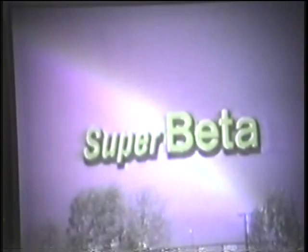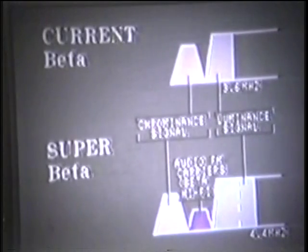But first, let's examine the difference between SuperBeta and conventional beta. The most noticeable difference in SuperBeta's technology is the dramatic increase in picture quality by up to 20%. Here's how. The black and white information, or FM luminance signal, which contains all the picture detail, has been shifted to a higher frequency. In fact, the shift is 800 kilohertz, from 3.6 megahertz to 4.4 megahertz. The shift makes available more video information, or luminance, creating finer detail in the lower sideband. The finer detail, combined with SuperBeta's special circuitry, keeps the picture clean and crystal clear.